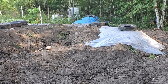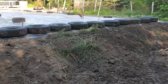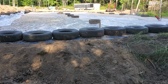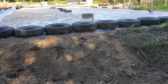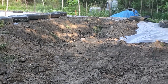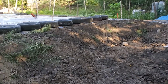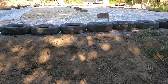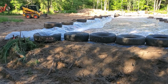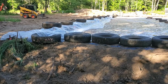What's going on, guys? Day 2 of the Earthship build. We got everything leveled off here. There's sand that's tamped down below the plastic, and then we bermed it up with heavier dirt so that it stabilized. We got to bring in a ton of dirt for this side, and in general, this is one thing that you have to prepare for. And we don't have really room to store the dirt, so it's just gonna have to happen in phases.